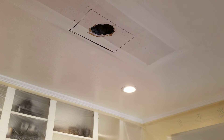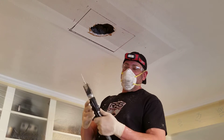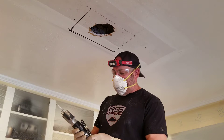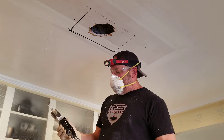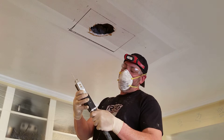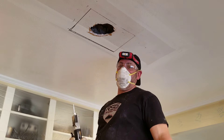Today I'm going to show you the best tool for cutting drywall that I found. It's basically a body saw — an air body saw, and I got this one at Harbor Freight. Obviously, you can find some that are a little better. Basically it's a Central Pneumatic high-speed metal saw is what they call it, but it saws through drywall beautifully.